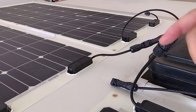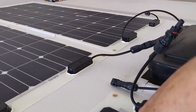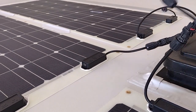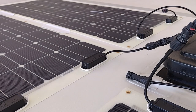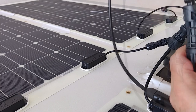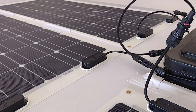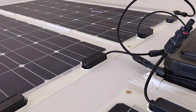At this stage we're connecting this solar panel to the one the camera is sitting on. The two cables on the solar panels don't reach — they're not long enough — so we built this extension cord with the MC4 connectors to connect them. We pop these connectors on, and now all of our solar panels are connected to one another in series. We're ready for the next step.